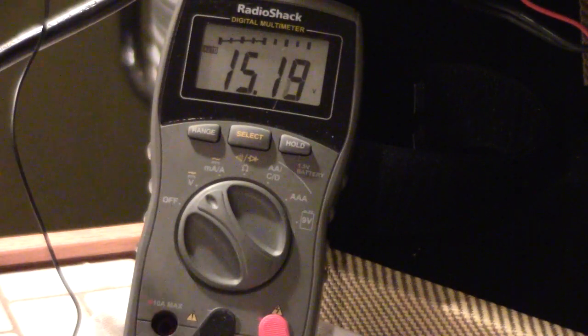At this point, you do not touch inside of this amp anymore. Right away you can see the voltage flying up — that already is enough to hurt you right there. That's a lot of voltage, it will zap you pretty good. We're going to let this warm up. If I turned it right back off now, it would hold that charge. But we're going to let this get warm enough to play. Now if I plugged my guitar in, I'd be able to play it — the tubes are hot and ready. Now we're going to flip it off, and watch the current drain.